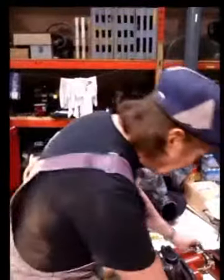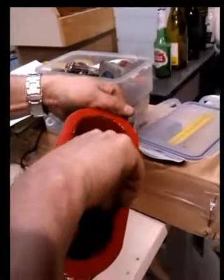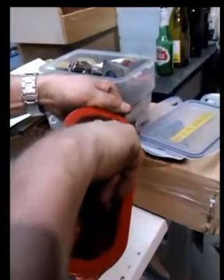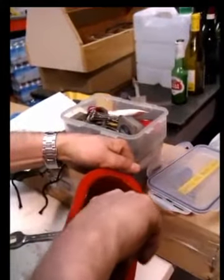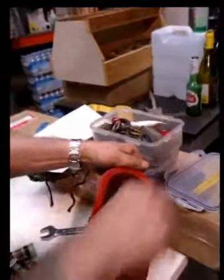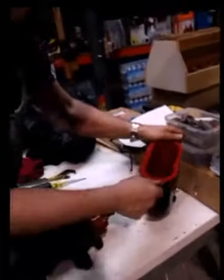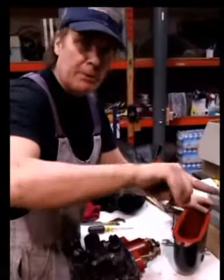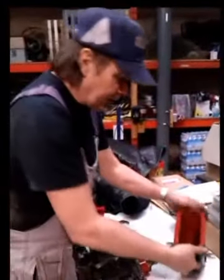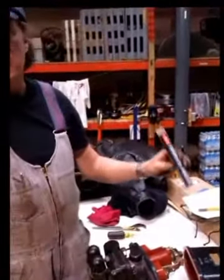I've used it on the inside of this cover to fill a couple of holes, and I don't even see where I did it. It's right there. There was a big chunk missing. That's all arc putty in there because we didn't want the flash from the governor cutting out to ground on the cover. So it's used for that type of application where you have high heat, high temperature, and you may get electrical flashover. So you can use it to fill holes in arc barriers, anything like that at all. It's great stuff. I've tried other brands, but this CRC Minuteman seems to work very well. Good.